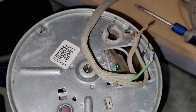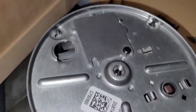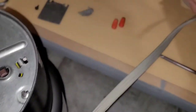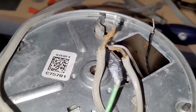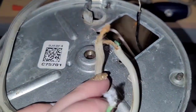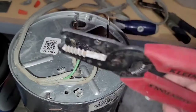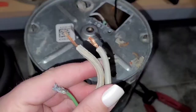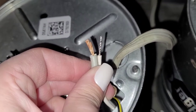We're gonna play a little bit of electrician. My question is: why on earth am I having to wire the plug? Why wouldn't it just come with a plug? I'm having to pull this out with a black wire, white wire, and a ground green wire, and I'm gonna have to wire it into this one. If you can't tell which of these two is going to be hot and neutral, sometimes you're gonna have to strip back some of the rubber if they're too old — so you've got your handy-dandy wire strippers. Sometimes that still doesn't help because there's no indication. To wire two wires together, you just put them together and twist them.